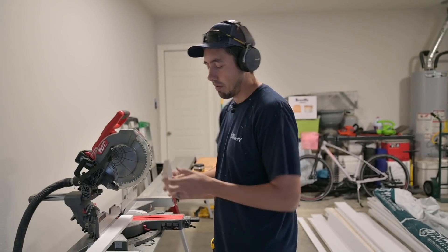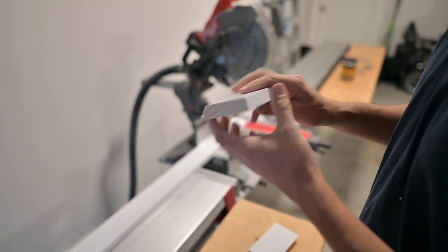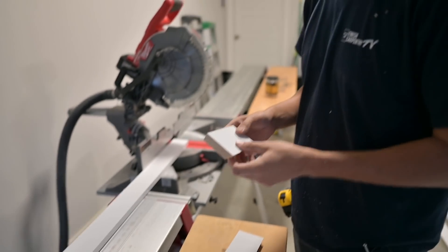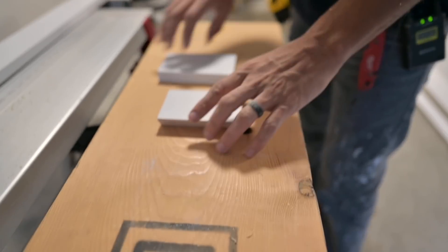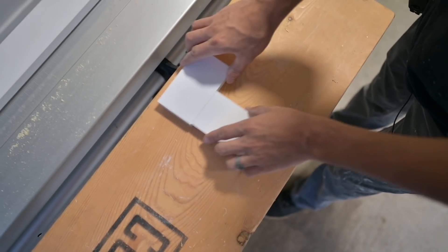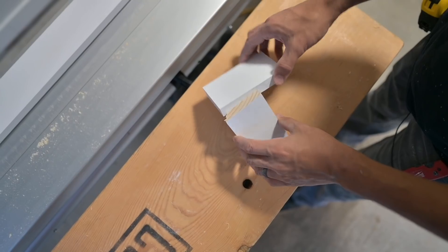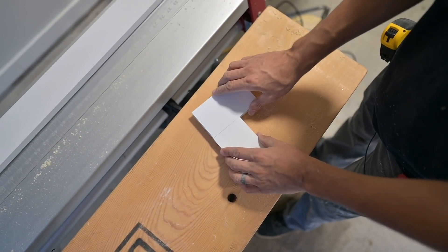This is our half perimeter board right here. You can see it has this 31-degree angled cut on it, and that's so it can hug to the drywall tighter. Now where these boards are going to join in the corners, you're going to have one that's to this wall with that bevel, and then one that's to that wall — so it'd be just like this.